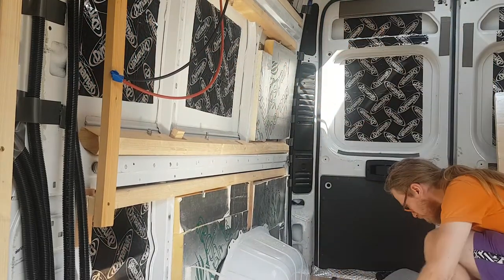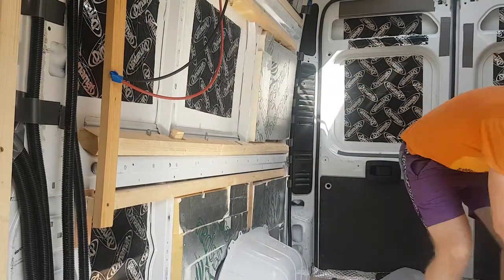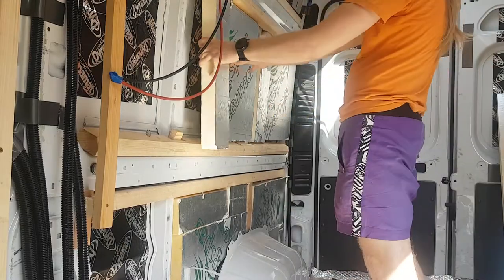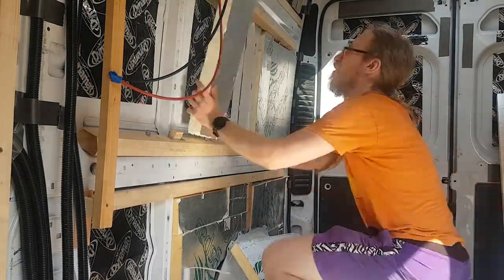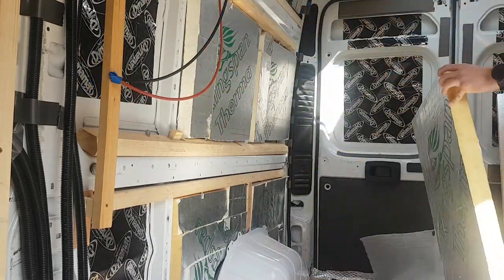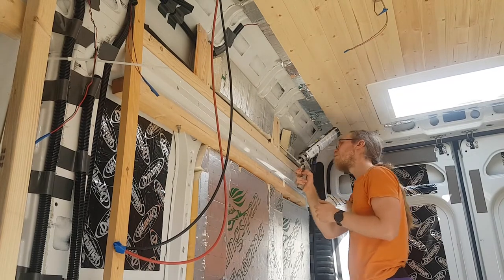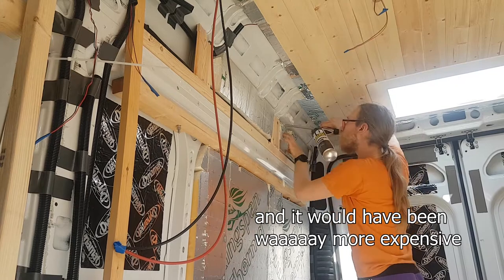Once it was all friction-fitted, I got out the spray foam gun and attacked it to actually stick everything in. I really had no reason to be worried about the spray foam — it wasn't that big a deal, it's actually kind of fun to use and works really well. Yes, it can be messy and a bit dangerous, so wearing gloves and clothes you don't care about is a good idea. It does a great job sticking insulation board onto walls, and once it hardens it becomes rock solid. I'm really glad I insulated that way — both the heat and sound insulation properties are really solid. I don't think even a layer of pure spray foam would have given me the same sound insulation, so I'm happy with the balance it struck.